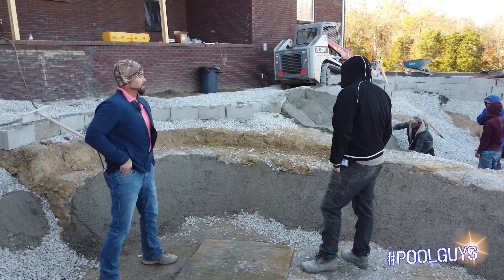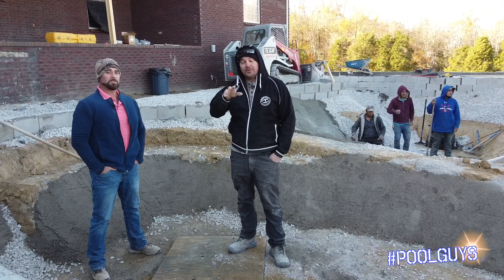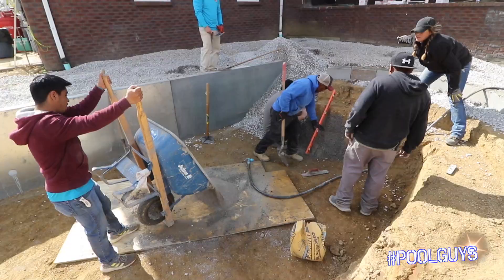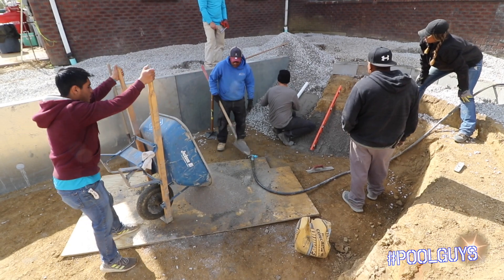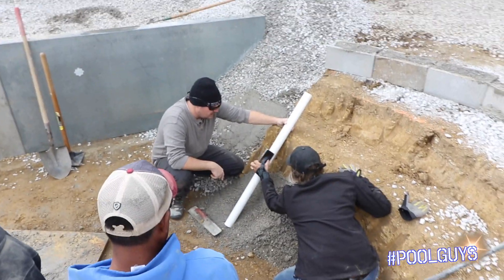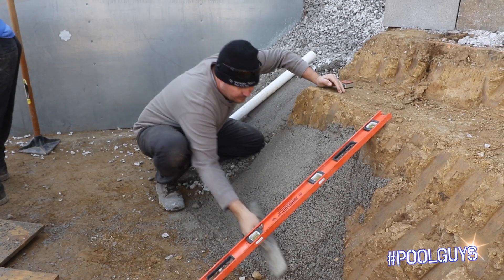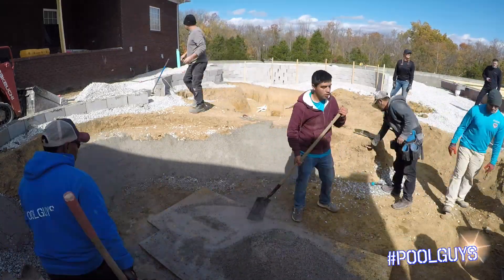It's a little bit unusual having to go this direction. Because as I said before, we are shaping the final shape — the actual final shape of this pool is being done right now. What we're having to do is to get our sloped walls, we're adding a mix of Portland cement and limestone screenings. We're mixing that up and actually getting our slopes and our contours for the walls and for all the seats, benches and what have you through the pool. So the idea is now coming through, as you can see in the back here, a little bit more finesse shaping of this pool.